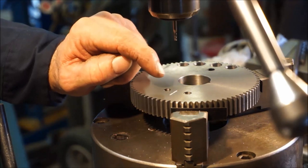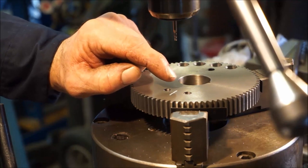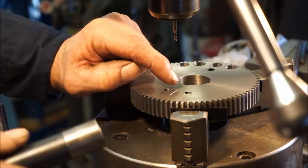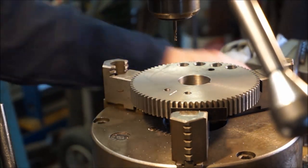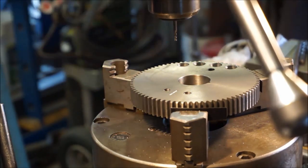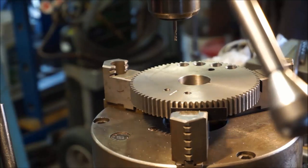I didn't break that and I didn't take any chances. It cost me, I don't know, about 2 minutes to even explain my reason for not doing it, and you can just drop your collet, crank and let the table come on up. The time that you think you're saving by letting a foolish trick like running an end mill in your drill chuck, no matter how true or how great you think it works, you're extending the spindle out farther and farther, and you're trying to cut something, especially when you've got carbide. Carbide is brittle. It does not like to move around.